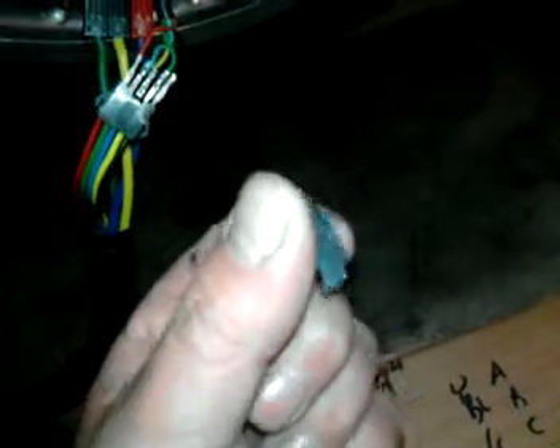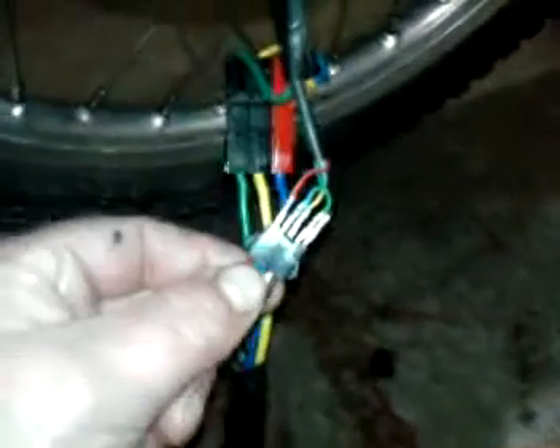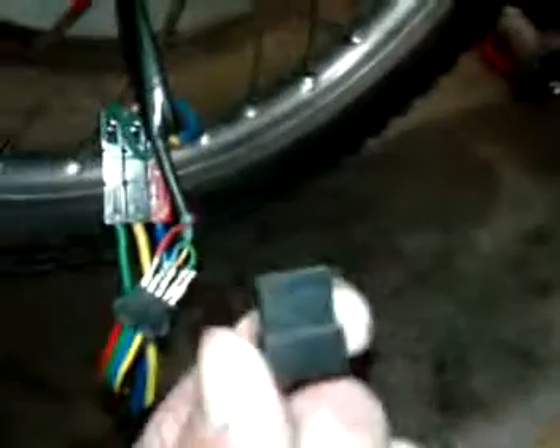It's best to, before you go ahead and push your pins into this little connector here, test it before you do that, because they're really fun to get out of there. So if you got to make that XLR to flat sub-d connector or whatever these are called, test it with the pins carefully first, make sure it works before you push them in.